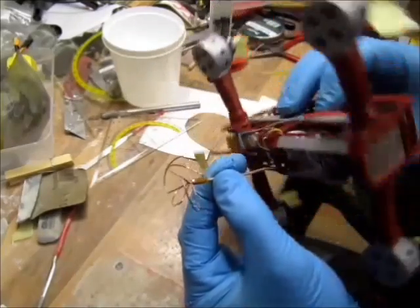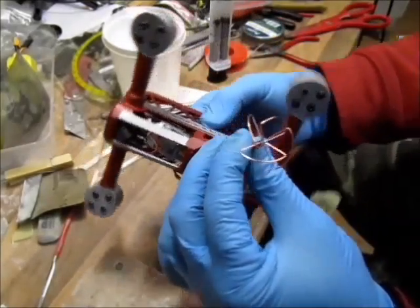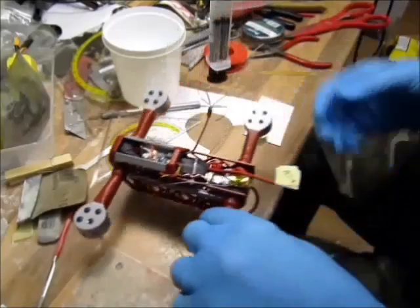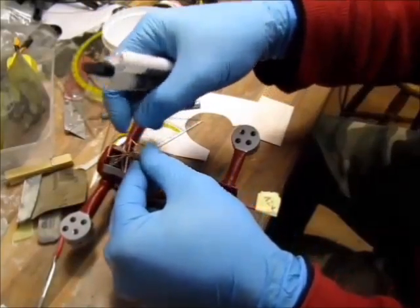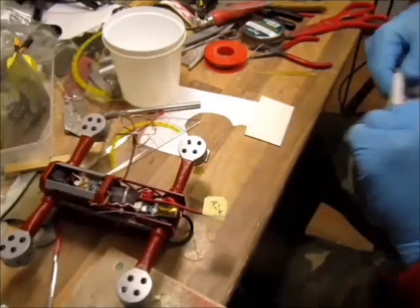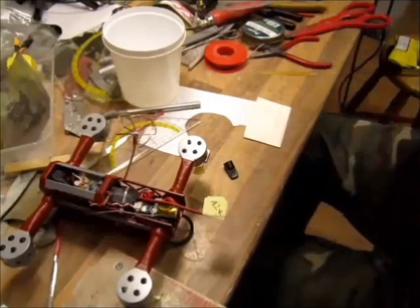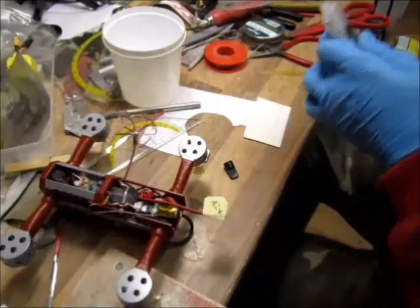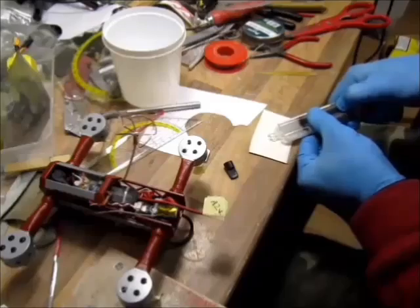So I have here checked the bottom's all 90 degrees, this one's all square, the rest is 45 degrees, and we're good to go for the next step. Now, to get there in the middle, make sure it doesn't come off, I'm using epoxy resin. So there's a two-part epoxy resin. It dries in 5 minutes or something. I like when it dries fast, because I have little patience on this matter, but at the same time I have to work fast as well.